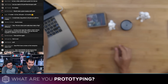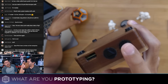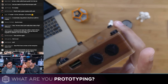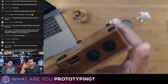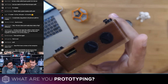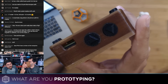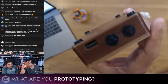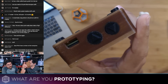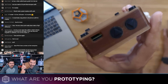You have to print it a little bit colder, right? And I actually had to use the 1.75 millimeter filament for this, because the 3 millimeter just would not print on either. It would constantly grind, no matter what setting we tried, it just kept grinding away. I printed at 230, 240. I started out at 200, and that just completely ground up. So the 1.75 millimeter filament for the protopasta conductive filament worked out the best. For some reason, the 3 millimeter filament for protopasta was super brittle. It would always break on both the Sigma and the Ultimaker.